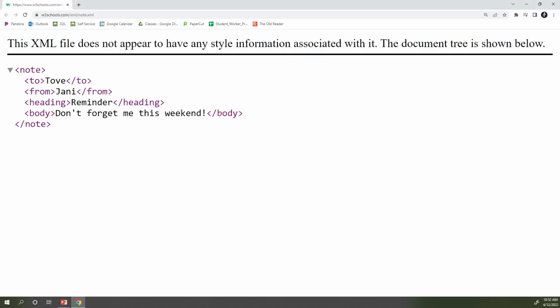It'd be configuration information. So, are we using mode 1 or mode 2 on this device, if there are multiple modes? Parameters, what type of information are we going to be able to grab? Modules, how many, is it a 1 module or 2 module? Is it a rack? Diagnostics and alarms. Like, oh, we're having a problem. There's a diagnostic on there, so we know where to check for that information. Who the vendor was, that vendor information, and also other device information. So XML can be a super powerful tool when used correctly.